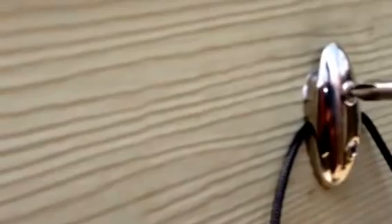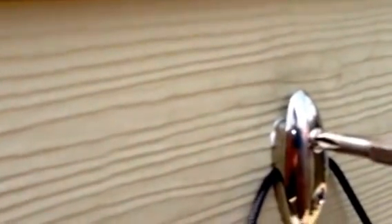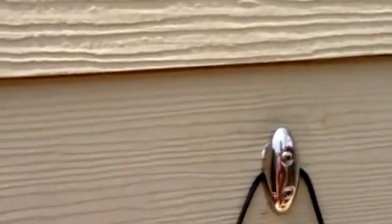And then we're going to start our lower screw. So I'm going to be using this hefty hanger for the purpose of holding my outdoor garden hose. Really nice and tight. I'm using number 8, one and a quarter inch, just because it's for house use, it's going into the wood siding here.